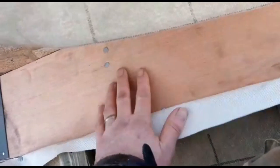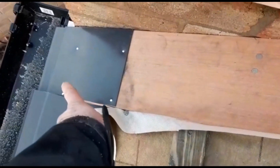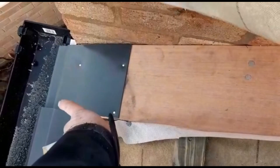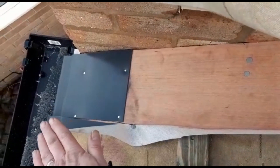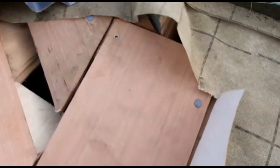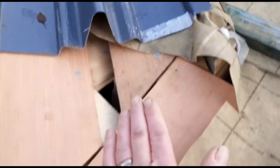You can see I've put the wood in place. I've put my eaves protectors on. That bit of the fascia bar I've had to cut down so that goes straight into the gutter. This one's slightly raised for the tile. I've got a solid base now, all the way up where it terminates there, part of the slope.